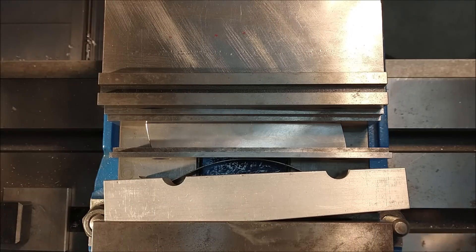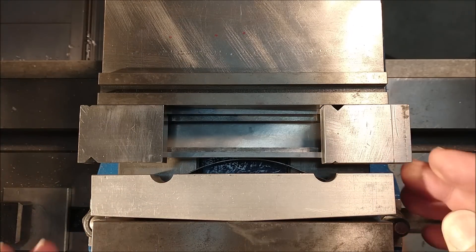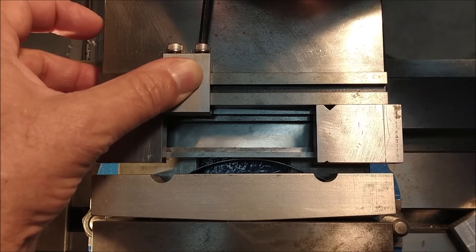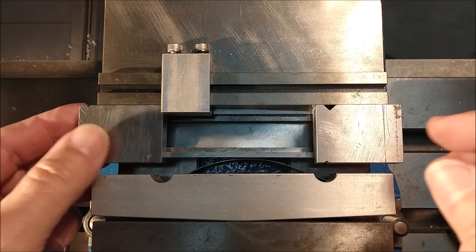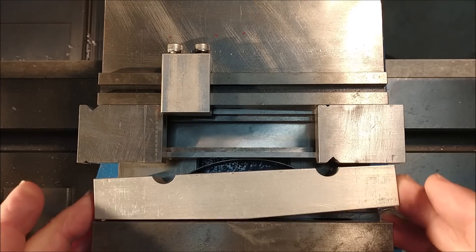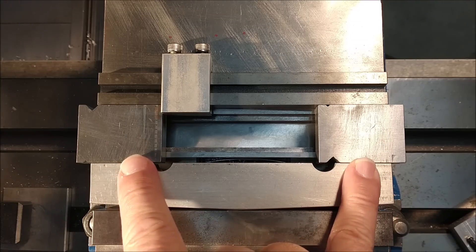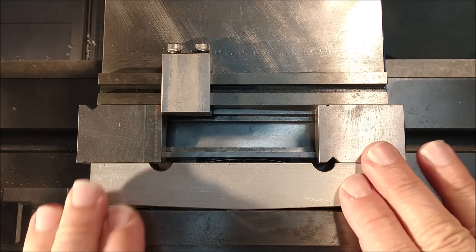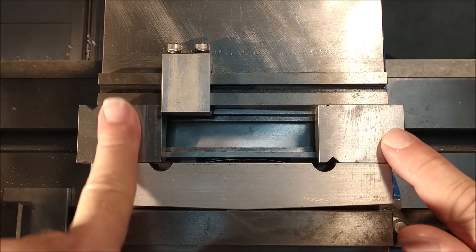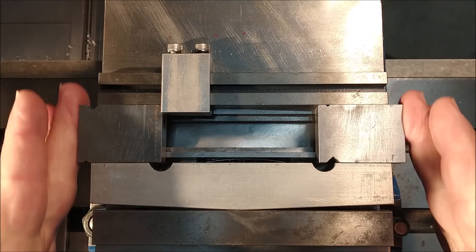How do you overcome that? You overcome that by using a piece of equal size on the opposite end. If you're using a stop, then use your stop. Once you've milled your first part, put that good part on this end and then move on with the rest of your parts. Same possible movable nasty jaw - as it comes closed, it's going to find its home because it's got pressure on both sides. This is machining 101. This is as basic as turning the machine on. When you set something up, if you're going to use small pieces on one side of the vice, put a small piece on the other side of the same size so that you don't get that movement and you don't have any problems.